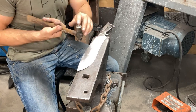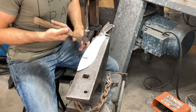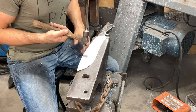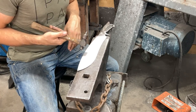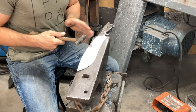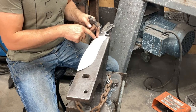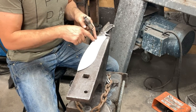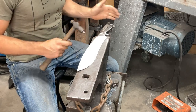Hard enough to where I can see little dents from this. The blade is at like 59 Rockwell, but this is carbide, so it'll dent it, no problem. I'm just making an expanding pattern of small dents with the lengthways axis of the dent this way. So it's working like a cross peen on the surface of the material, or straight peen, and it's stretching the skin of the blade this way from point to butt of the knife.